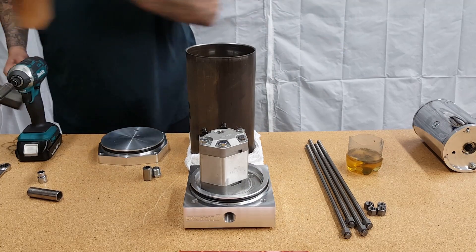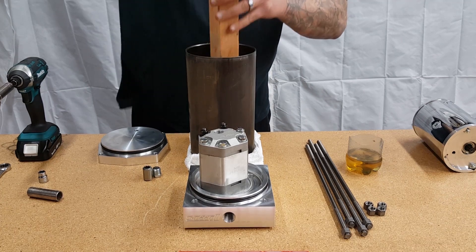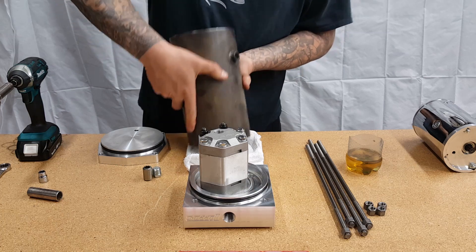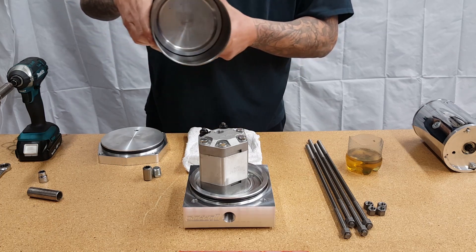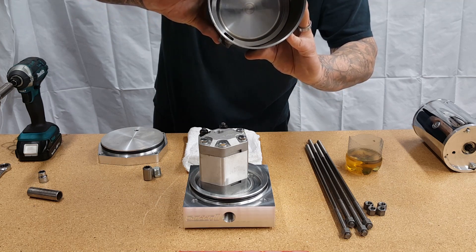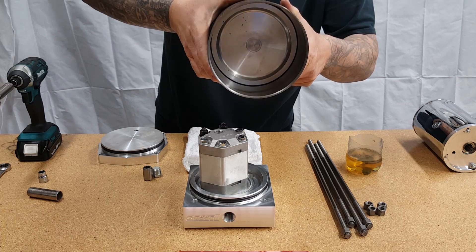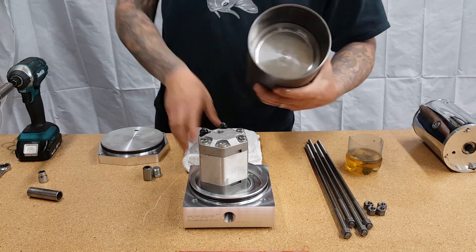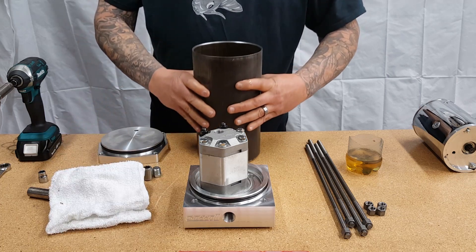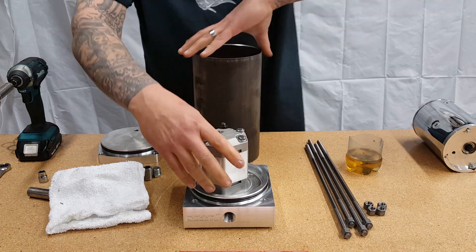He's going to show you — slightly put it in. On the piston there are going to be two different sides: a flat side and the open side. You'll see it has a greater indentation — a deeper hole on the actual piston. The opposite side, which is going to be closer to the backing plate, is going to have a shallower recess. The reason for the recess is so the gear has a little more clearance when the piston is traveling in and out, forward to back, inside the actual tank.